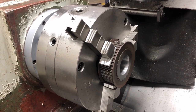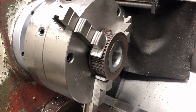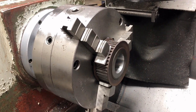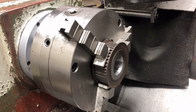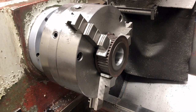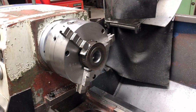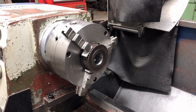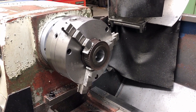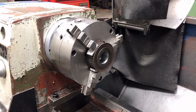The Woodruff key that holds it in place broke out the keyway in the pulley, and then the pulley just spun on the compressor shaft till the next morning when someone came in to check on the machine. It buggered up the bore of the pulley. They ordered a new crank and a new pulley — after waiting about four weeks, the pulley that came in was wrong.